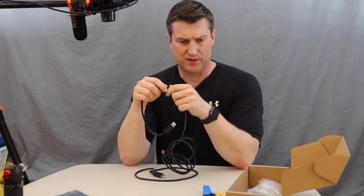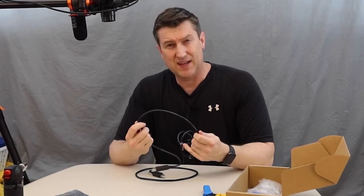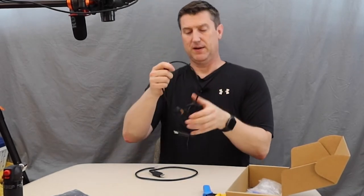So one of the problems you can have, especially with some cheaper wire strippers, is that it's possible that when you cut into this sheath to expose the 6 cables inside, you actually cut one or two of those wires, and then you'd need to go back a little bit further into the cable. We want to give ourselves room for that. And while we want to get rid of as much cable as we can to eliminate the extra weight and the opportunity for cable snags, it's okay to have a little bit of leeway there. So don't worry about that so much.